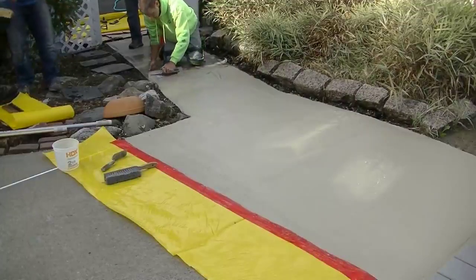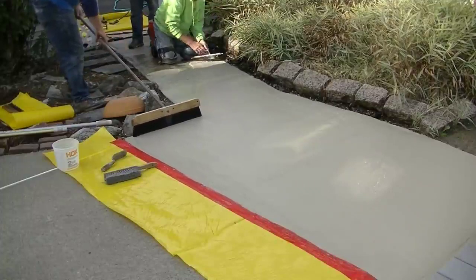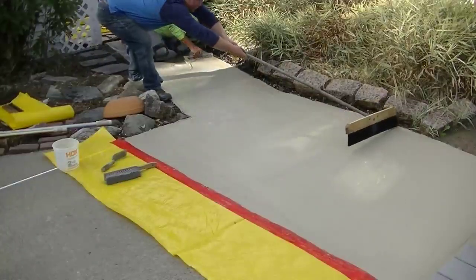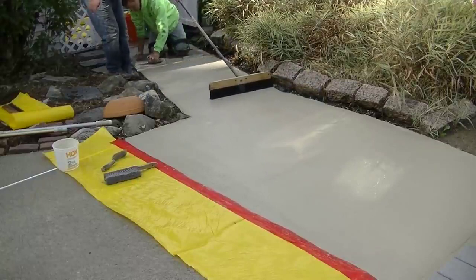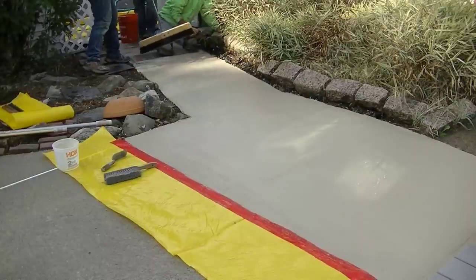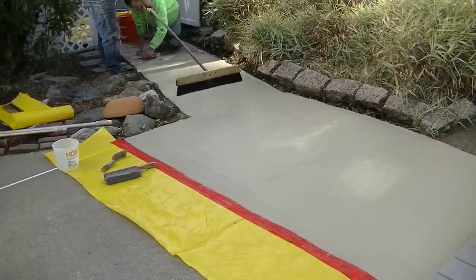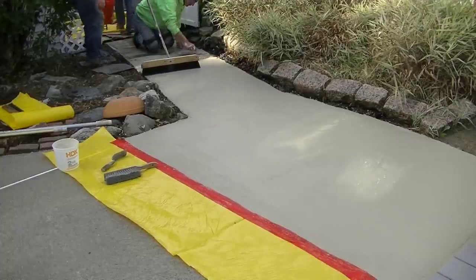It's a little bit of a process — you can see how long it's taking me to get down the walkway making sure everything's spread out really nicely. I don't really want to run it over the edge and make a mess, so I'm just taking my time. Luckily I've got Luke running the broom and Darren behind me doing the mixing, making sure I've got enough product and keeping the concrete damp behind me. That broom really takes out all the imperfections — Luke's also cleaning off the broom after each section to make sure the resurfacer doesn't build up in the bristles, so all the texture looks the same from start to finish.